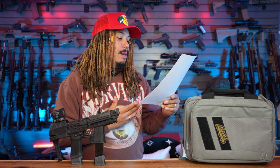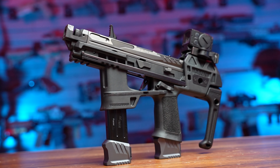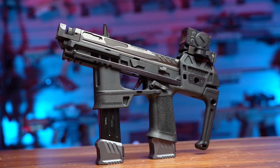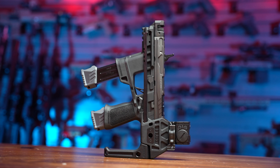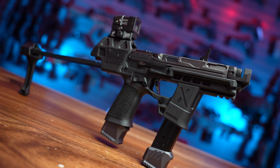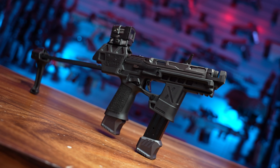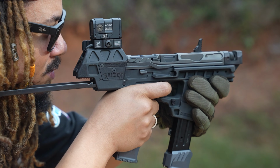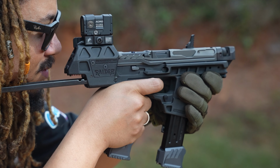So what is the SPT? SPT stands for Single Process Technology and Single Point Technology. Single Process Technology means the bore, rifling, and chamber are cut in one high precision machine without human interference. Single Point Technology means that the rifling is cut using the legendary and painstaking single point cutting technology. This single point cutting rifling process requires a single cutter to make 120 individual cuts to accurately rifle each bore. Single point cutting yields identical grooves that have less than 0.001 deviation between each other because they are being cut with the same exact cutter.